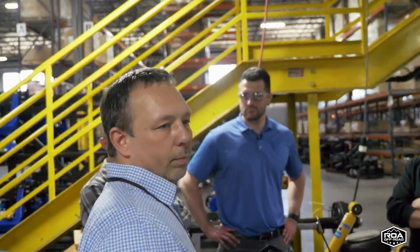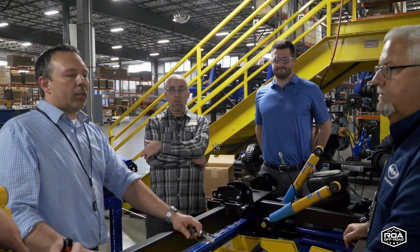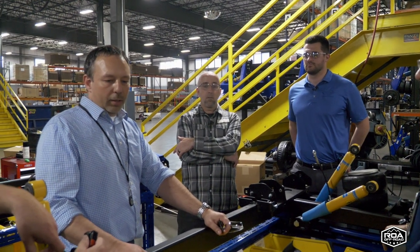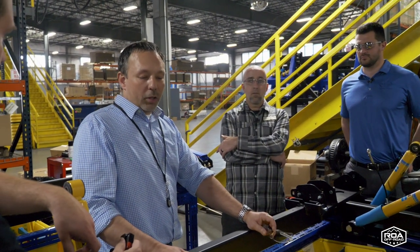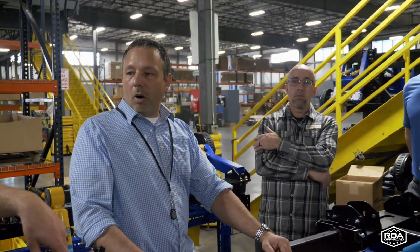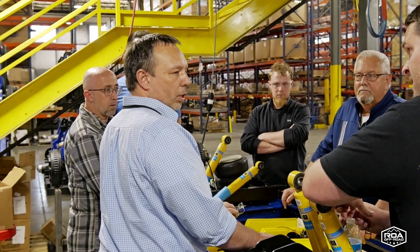And I'll add that with 1,000-mile durability, at the end of it, you're expecting failures because that's typically viewed as end of life. So in the durability world, you take it to 1,000 miles, it hits the right course, and so 1,000 miles equates to what in lifetime travel? They usually say it's the equivalent of, different companies have done it, I won't mention them, but major companies run 1,000-mile durabilities and assume about 25 years of hard use. So think everyday delivery type vehicles, those types of situations.